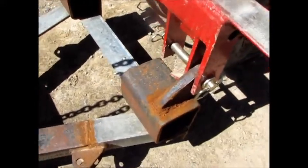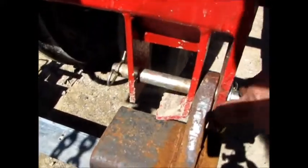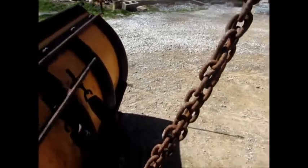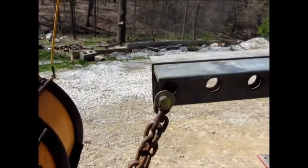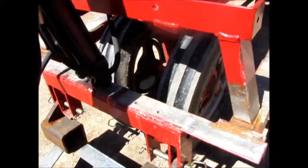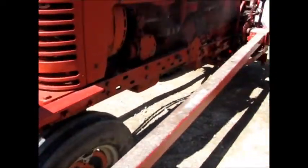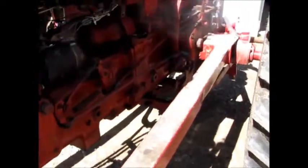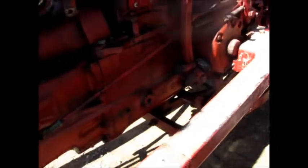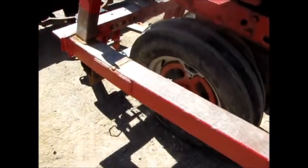I can take the plow off real quick by pulling these pins, and right now I got a bolt in the lift chain. I'm gonna eventually put a quick connect on that chain, but by pulling them pins and pulling that bolt out, I can drop the snow plow real quick. Then I made it so the push arms come back here, push off of the rear end so that it's nice and strong. I still need to paint the top of my push arm brackets,